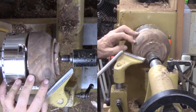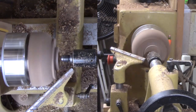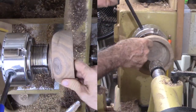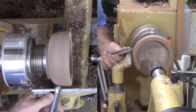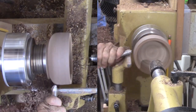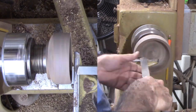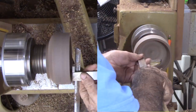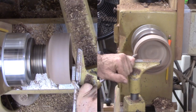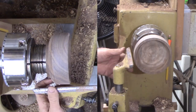There was no way I could glue this one together. But now I have a very nice lid but no box to put it on. I searched around for an appropriate block of wood — I need a piece big enough and already dry. After a search, I found a bowl that I rough turned several years ago but have not gotten around to finishing. The main criteria is that the lid can fit once the warp is removed. I start with the same process as finishing a bowl — first press the bowl against the chuck with the live center while I re-cut the tenon. Then reverse the mount for a more secure hold. There is not a lot of wood to spare. The outer diameter is a bit large and I need to cut that back. There is not much wood to spare on the bottom either.